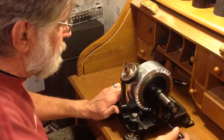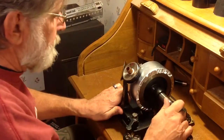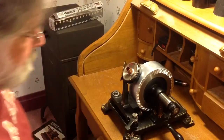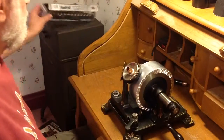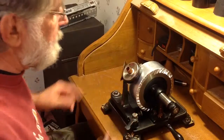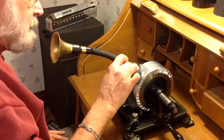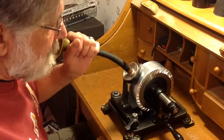So, we'll go back to our starting groove, which is right there — that's the first groove on the mandrel. We have our stylus holder locked in position. Everything is set. We're going to be recording on heavy-duty aluminum foil, made in Armenia, that's been cut into a two and a half inch strip. I've applied a glue stick to the shiny side. We're recording on the dull side. Let's see what kind of recording we get on extra strength heavy-duty aluminum kitchen foil.